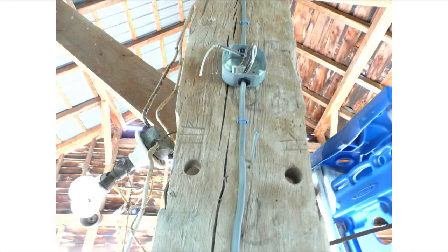In the middle right here, you can see a tie beam was taken out — you can still see the tenon, and you can see how there was probably wane on the timber, so they cut the post housing so it kind of aligned with the material at the end there. There was a question: as a traditionalist, do you use a front end loader or a forklift to raise the frame, or just manpower? I think I'm done. Thank you for joining us. The YouTube video will still be up on YouTube so you can come back to it and view it at any time in the future.